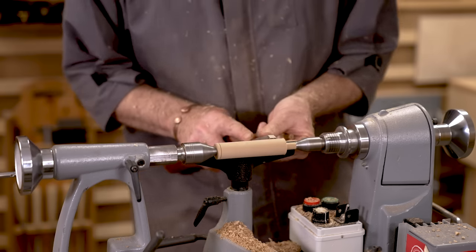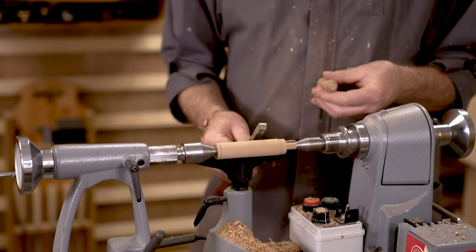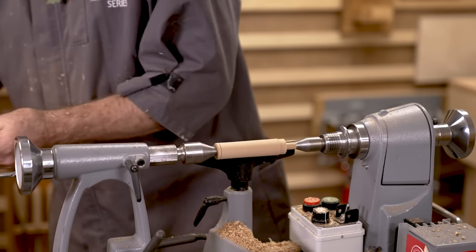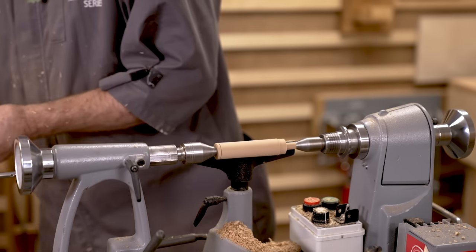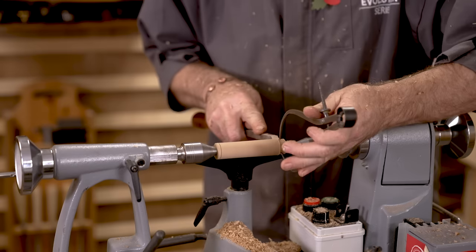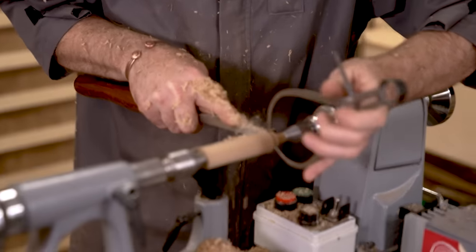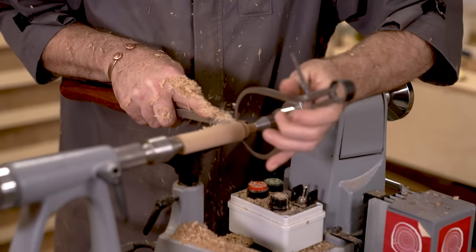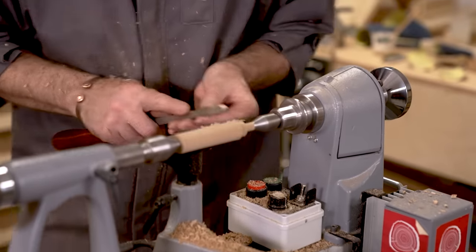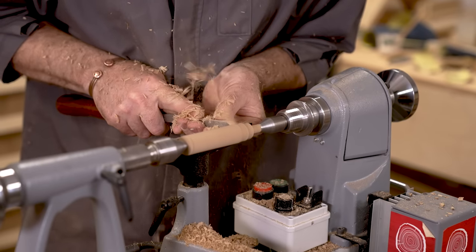Oh, bead, I'm really lazy. But this is the traditional way. The bead is the width of the chisel, 3/8. Let's get the right calipers. Which one do we use? Those. This has got to come down in diameter a little bit more. That's good. That gives me the width of our bead. I do a parting cut with a 3/8 beading tool.